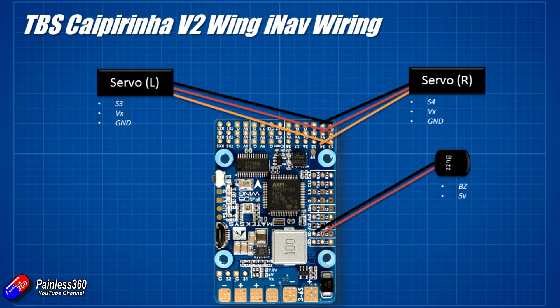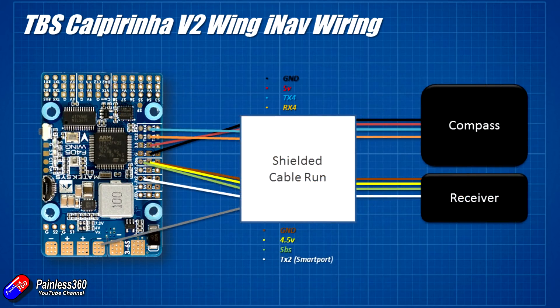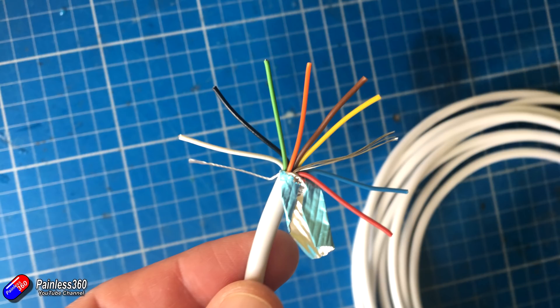Once I'd figured out how all the cables went together, I made a layout diagram showing which cores in the multi-core cable were going to be wired to everything. I color-coded this slide and had it on screen as I sat with a soldering iron, making sure I didn't make any mistakes. The shielded cable I'm using is the kind used to wire house alarms, but you can also use Cat5 or Cat6 ethernet cable — those have lots of cores inside and are shielded too. I also grounded the shield to a spare ground pad on the flight controller to minimise signal interference over that slightly longer run.